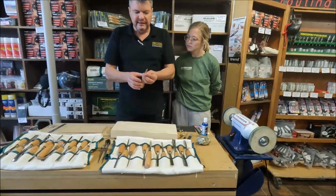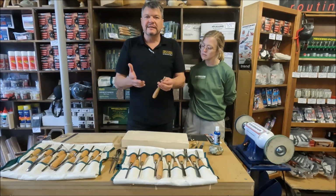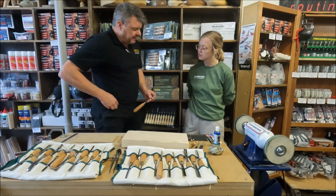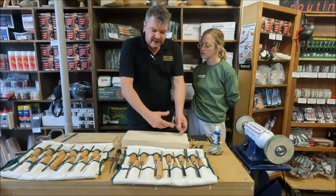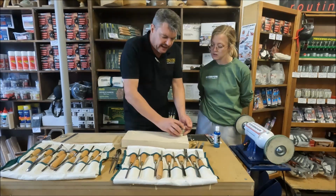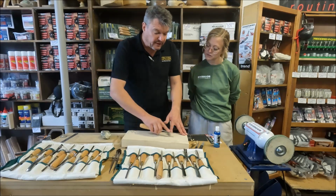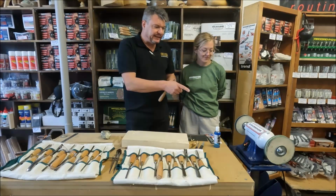the first step is to hone it. Nine times out of ten, general maintenance is just hone, well, we would say using a strop. You could just use a leather belt. Yeah. And the suede side on a piece of leather, if you turn that upside down and you get some honing compound and rub that down the leather, you could actually use that to put a polished edge, called a strop, on your tool. But there's a quicker way to do this, and that's this machine here.